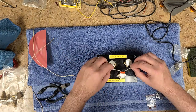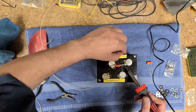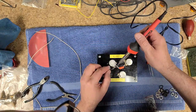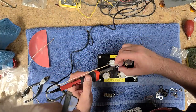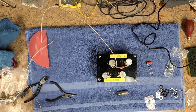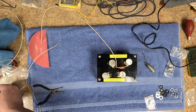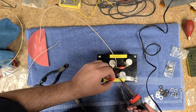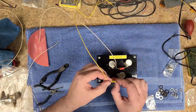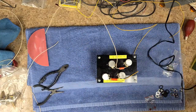I don't see why not using them for both — the slope from going from using an audio taper, I like the slope better. Some people say when you're using the guitar on stage — which I really doubt this is going to make it on stage — it's going to end up giving you a boost using an audio taper. Right now I'm putting in the orange drop caps on the neck position. I have a 22 on the bridge position and I'm using a 47 as my tone caps on this thing.